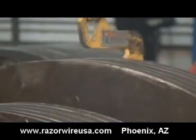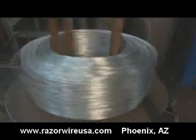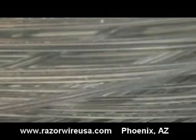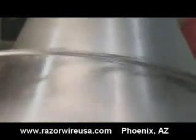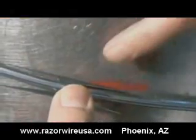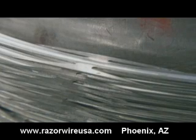But with the right tools, it's possible to cut through the sharp strips. So they're rolled up on huge wheels and loaded into a machine to be reinforced with a wire made of carbon steel. It's thin wire, a little under a tenth of an inch thick, but the carbon steel is so strong it takes 220,000 pounds of force per square inch to snap it. The barbs are fed into a machine one strip at a time, and spun out on the other end with the sturdy steel wire bonded to the barbs. Exactly how the two steels are joined together is a trade secret, but the steel wire runs like a spine down the center of the barb strip, making it harder to cut through or bend.